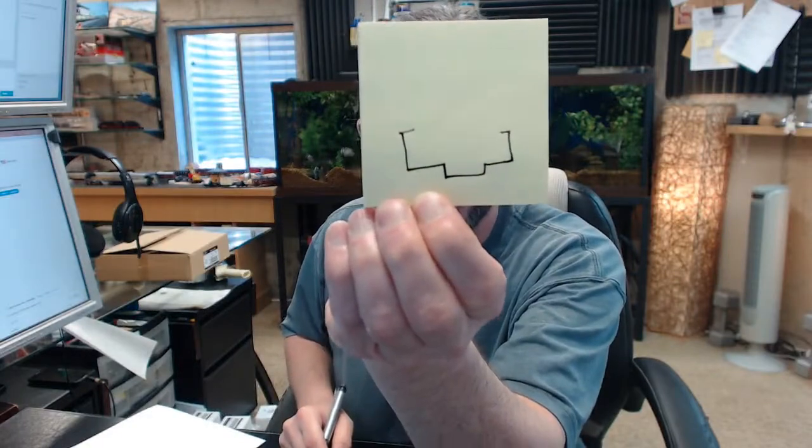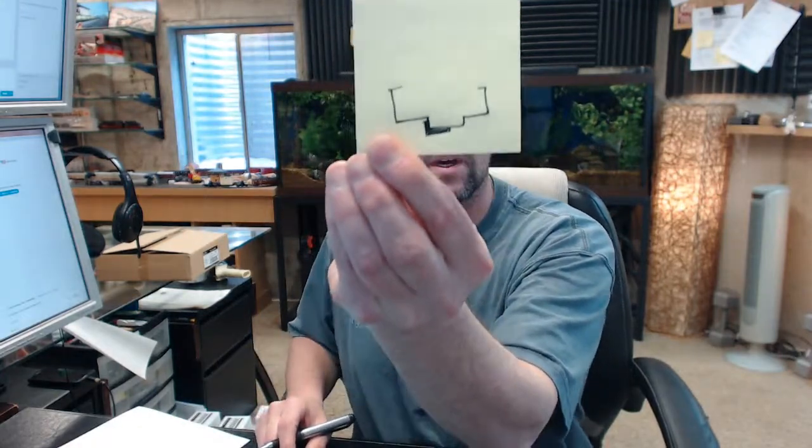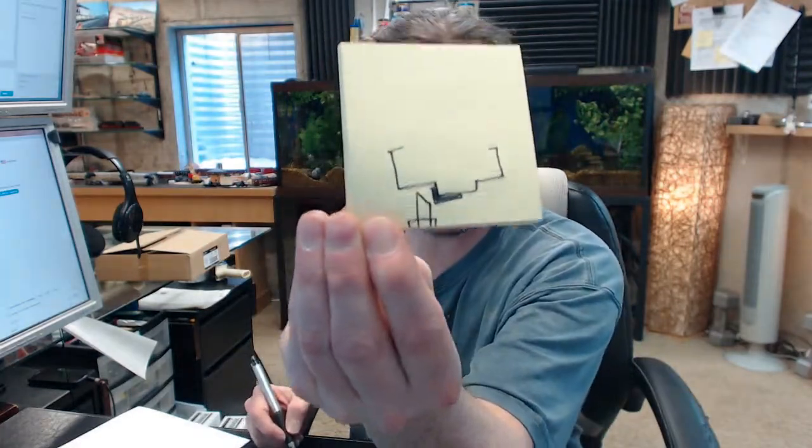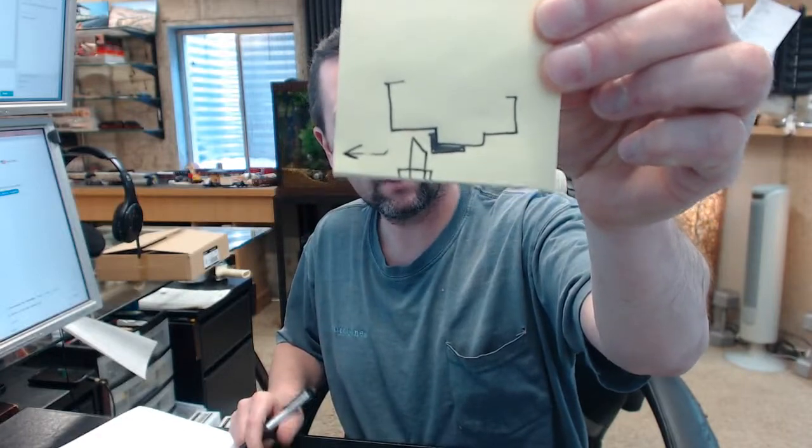Here's the header profile. Forgive the poor drawing. There's the header profile. You're going to need to make sure that your strike installation is going to look like that, okay? Because your bolt, this is an exaggerated view, is going to look like that. And obviously the door swings out in this orientation. Okay, so that's what your installation will look like. Wanted to be sure that I understood it to the point where it's been a while since I've installed a chain bolt, and looking at the instructions got me a little bit confused, so here we go.